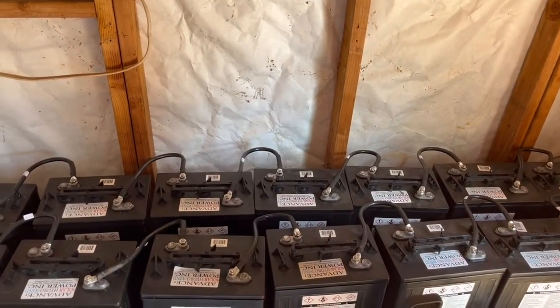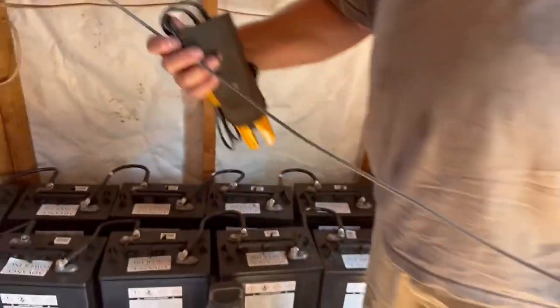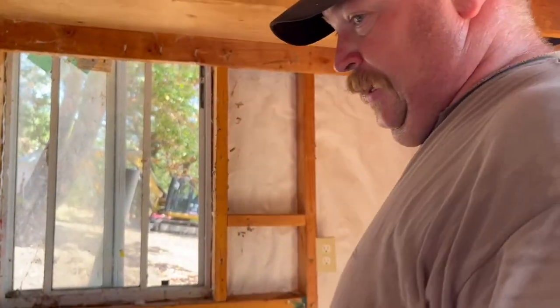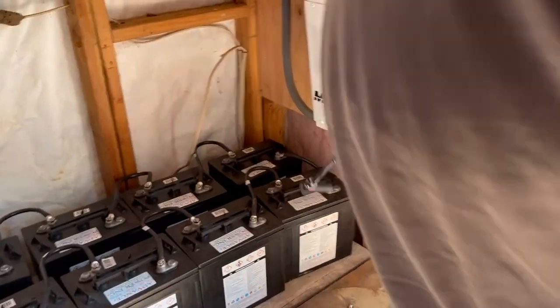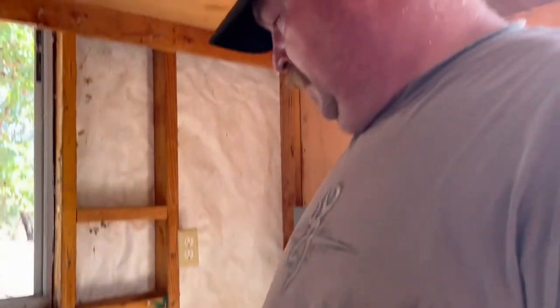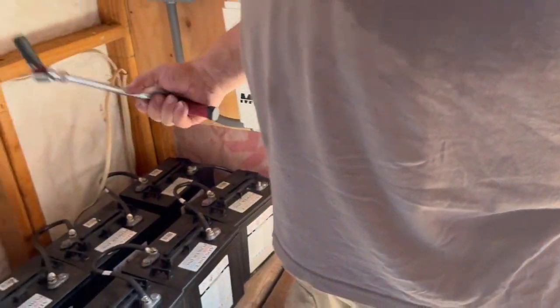We checked the voltage of each bank. Our multimeter leads weren't quite long enough so we had to use a jumper — just an extra piece of solar panel cable, a six-strand copper wire, which worked perfectly. We needed too many hands so we couldn't show you on camera, but basically you touch the negative on one battery to the positive on the other battery, and that gave us 48 volts times two. Now for the parallel connection: positive to positive on this one, negative to negative on the other — that will give us a bunch of amperage.